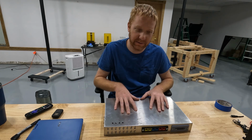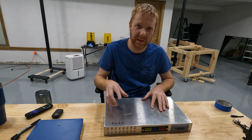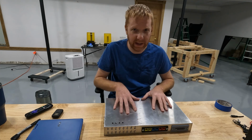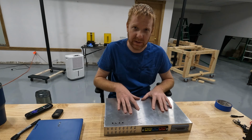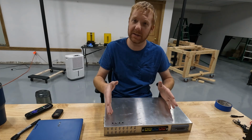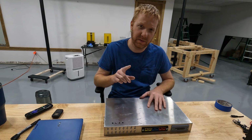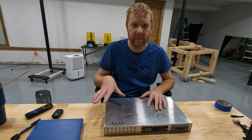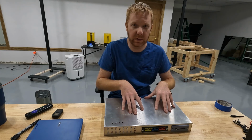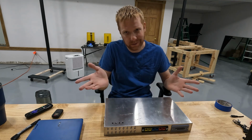The other thing that this controller doesn't have, on the Microsoft Adaptive Controller, there are two USB interfaces that allow you to plug in any USB joystick and use those. Again, that requires software, which we do not have in this system. I am going to build some joysticks that we can use. So I guess the big limitation there would be if there is an existing joystick that is really helpful to you that's a USB interface, we won't be able to use that. However, if you do use a PC, I'm pretty sure that you can plug this controller into the PC and also a different joystick if you have multiple USB ports, which you most likely do, and then you could use those together. Not 100% sure, but it's something that you could try.